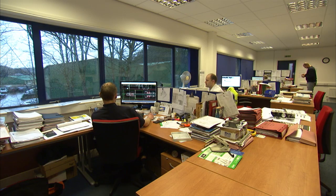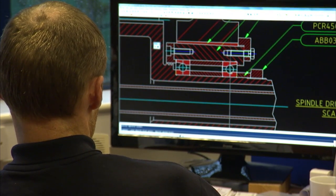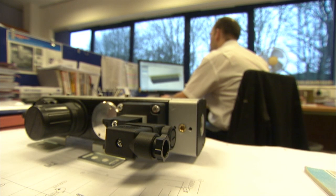If we want to do full prismatic machining, you'd put it on the rotary table and use it as an indexing table to present any facets around the component. And it's important to mention this machine is actually assembled here and a lot of the manufacturing is done in the UK. Most of the major components — the structural elements, the beds, the table, the column and the RAM — are all manufactured and machined within our group companies, with final assembly done here.